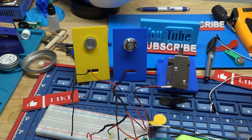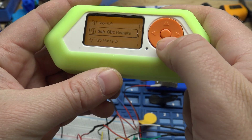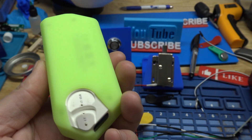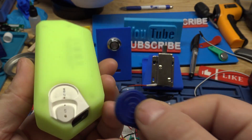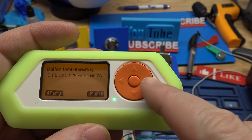And now we can actually use our Flipper Zero and copy it. So what we're going to do with the Flipper: go to iButton and we'll just go to read. I've got our pins on the back — it's labeled GPIO 17, which just corresponds to GPIO 17 on top here. Just touch it in there and it'll vibrate and beep saying that it read it.